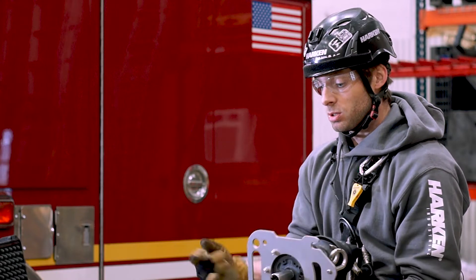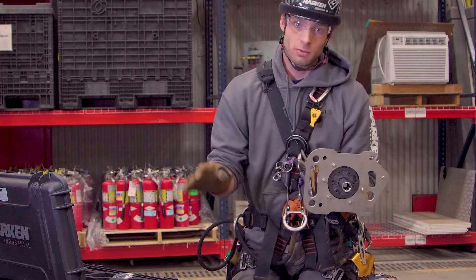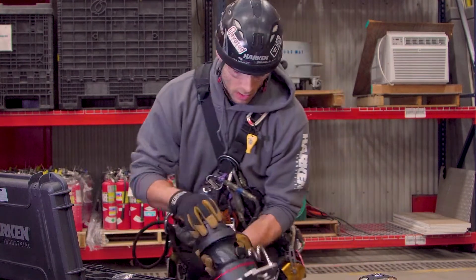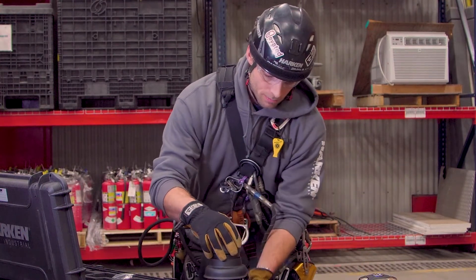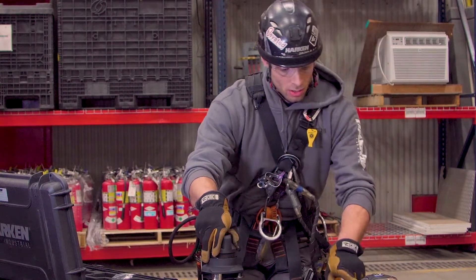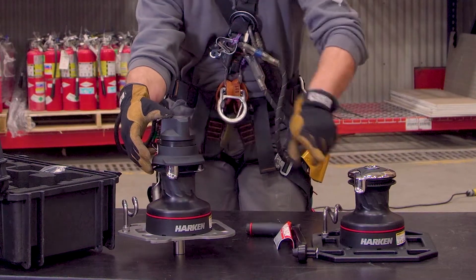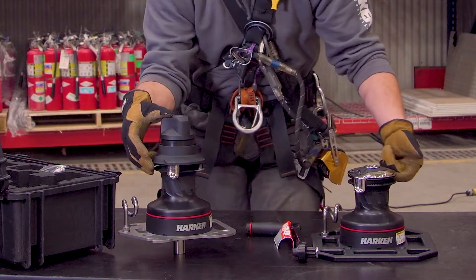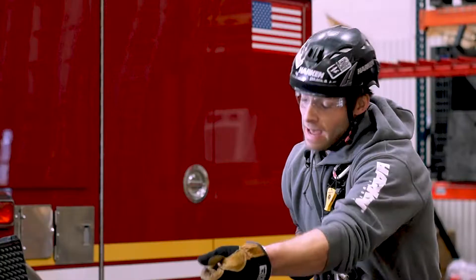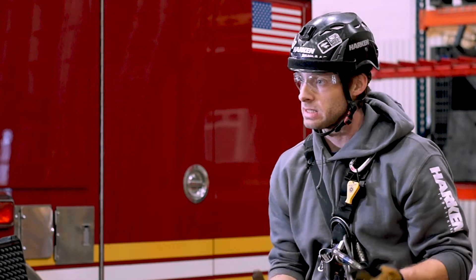This can also be used as a typical rigging plate with carabiner connections, fully rated in all directions. The big difference — hence the name Lockhead — is that we have shrouded our self-tailing jaw. This self-tailing jaw is what keeps the rope advancing without someone needing to manually tail the rope behind the winch to maintain tension.